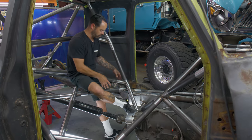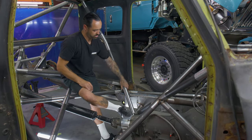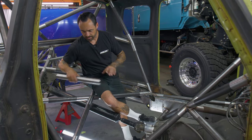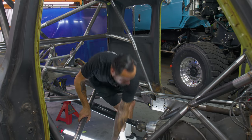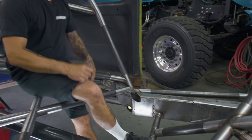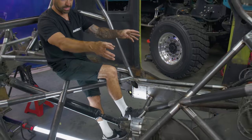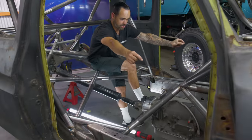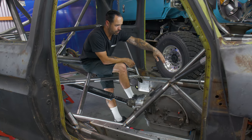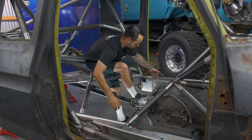So really now we have a chromoly pivot box, which is kind of like a mothership here. We have these pivots here. You can see there's a large notch. But what I wanted to get at is tying in all of our front structure. So like the end of that bulkhead, drawing in above the trans where we can still get the trans in and out, favoring the footwell area, drawing back out, drawing this chassis portion out, then we'll tie that in.